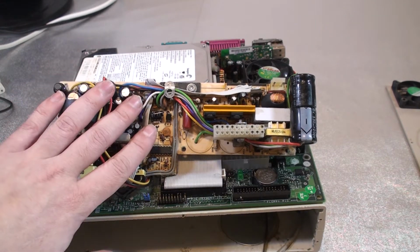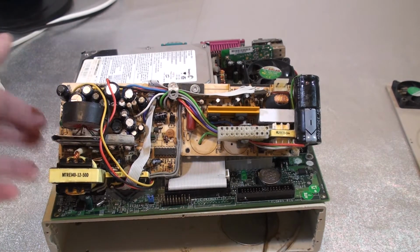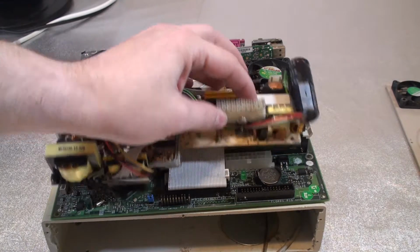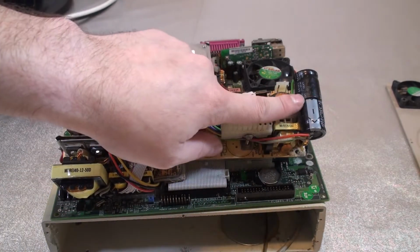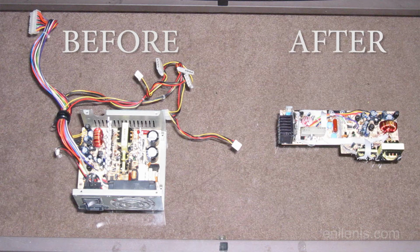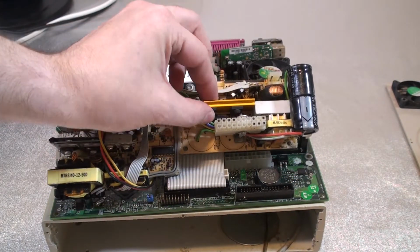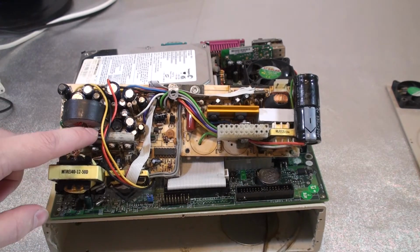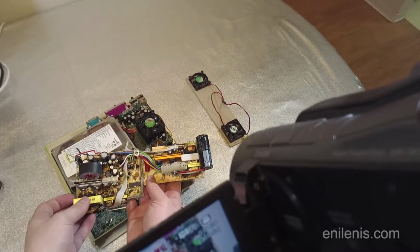This is the internal section of a standard typical AT power supply. I used a saw and I simply cut into it, and all I had to do was cut off the high voltage side from the low voltage and then put them on the side next to each other. And then I rewired this AT power connector and put it on another metal L-shaped bracket, which I screwed into one of the capacitor terminals, the capacitors that I have relocated to the right side. And then everything just somehow magically ended up fitting together. And I put my own additional little heatsink on this side for two of the MOSFETs. I think they were producing too much heat, and I made some improvised heatsinks on the other side as well, out of spare metal that I had laying around. Yeah, so even though this doesn't look very pretty, it just happens to function.